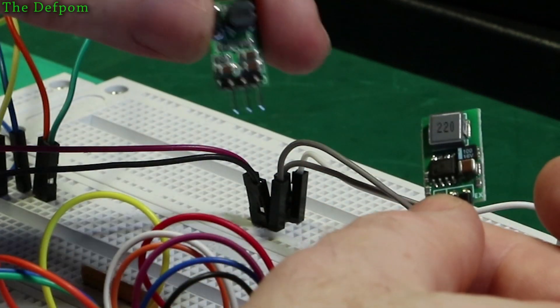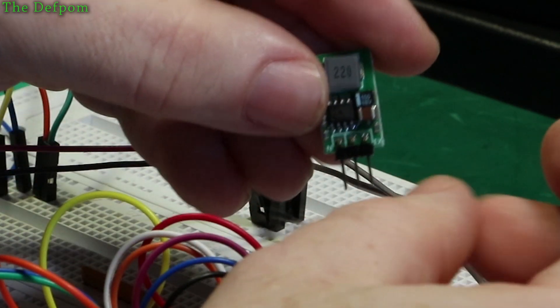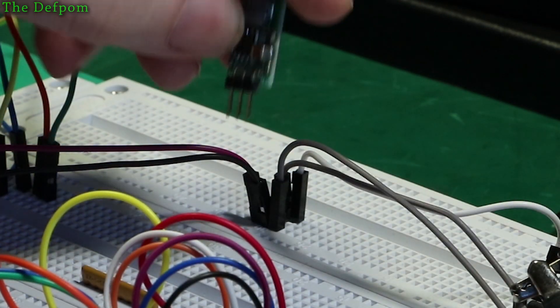You can see there's only one filter cap on this one — you've got a tantalum and a filter cap — whereas this one has got a few more filter caps on it. I think that gives it away a little bit about the engineering effort that's gone into these. We'll show you this one first, then we'll show you this one. I've got the scope set up and the DC electronic load, and it should be interesting.